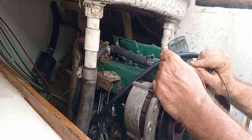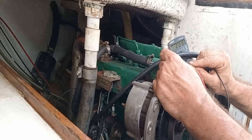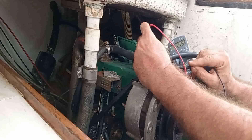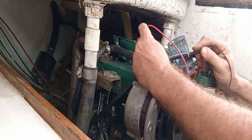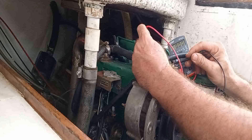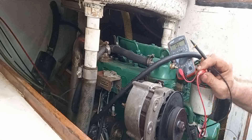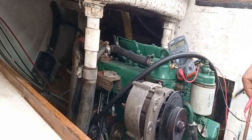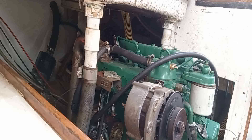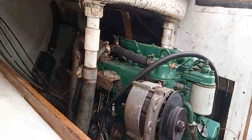0.91 kilohms — yes. You can also measure it from the body of the sensor, because that part has zero — well, very very low resistance. That's true though, it's essentially zero resistance between the body and the reference point.